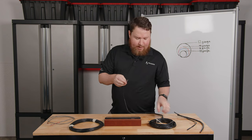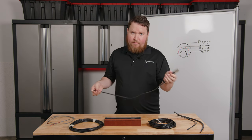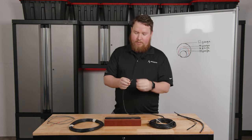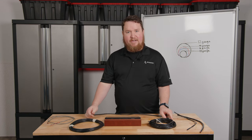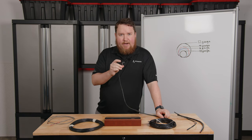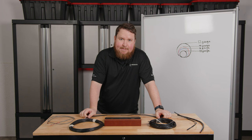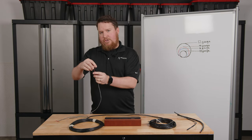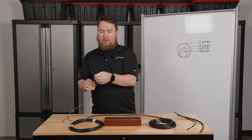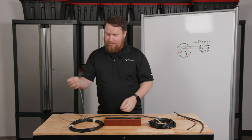To explain further: we do use shielded wire for inputs, like plugging in a microphone. This microphone cable has positive, negative, and shield — three conductors — where the shield acts as a ground. Since it's going into an input that will be amplified with an additional 30 to 60 dB of gain, we want that shield to prevent buzz or hum from fluorescent lights or other electrical cables. But speaker wire already has wattage on it and won't be amplified that way, so we don't want a shield that could cause a short or the capacitive effect issue. Instead of three wires, speaker wire has just two — unshielded.